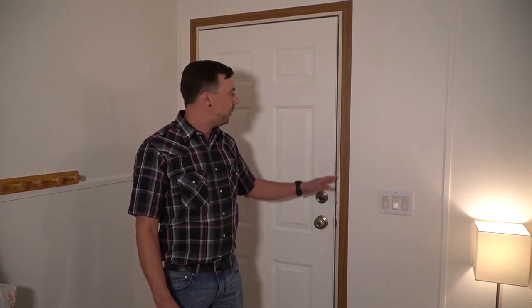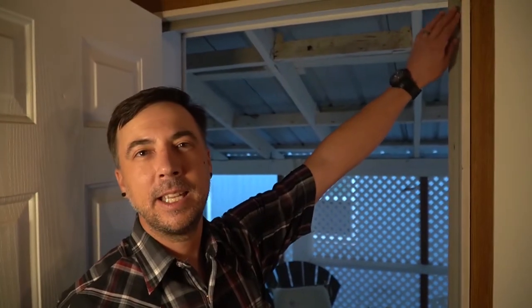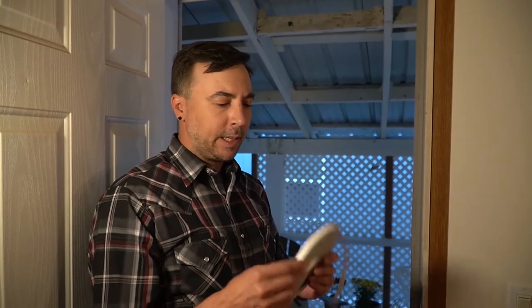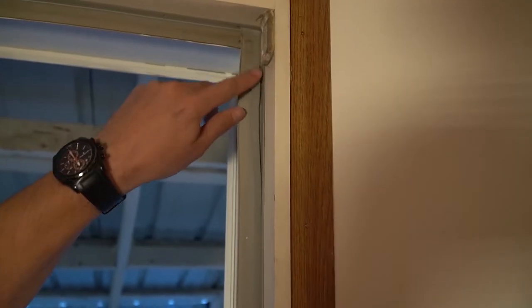Besides a well-insulated home, it's very important to air seal the home. Common culprits are around windows and doors — if you can see daylight or feel cold air coming through around a door, I suggest using foam weather stripping tape, which is easy to apply and fairly inexpensive. Here the weather stripping is worn and not sealing well. Weather stripping comes in many different thicknesses and widths. You just cut off the section you need, peel off the backing, and stick the adhesive side to where the door meets the jamb. After installing, make sure the door still closes and latches — if you can still see daylight, you may need to double up the thickness or get a thicker tape.